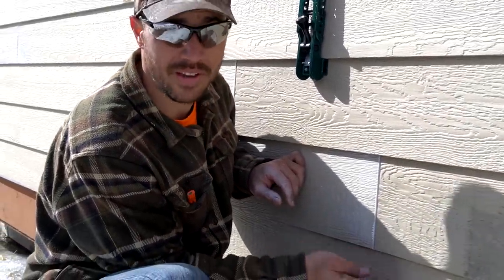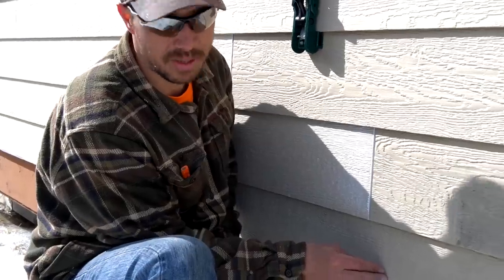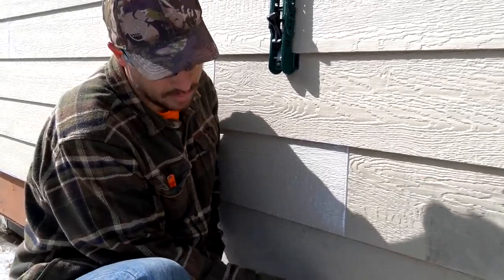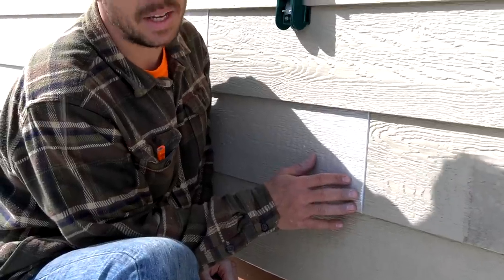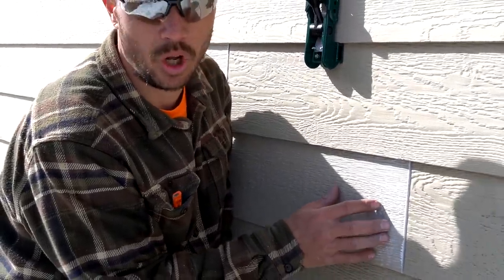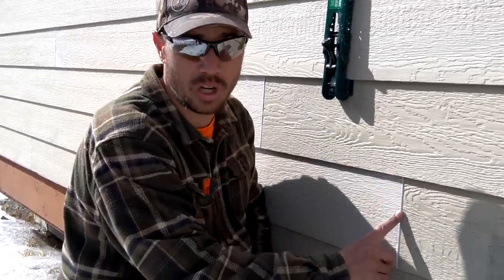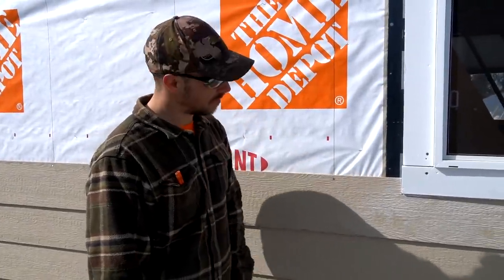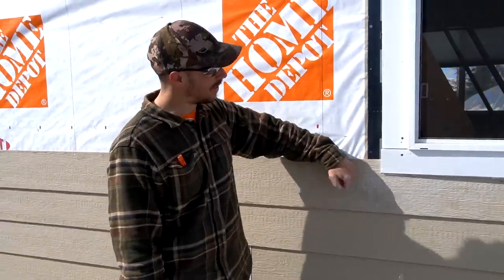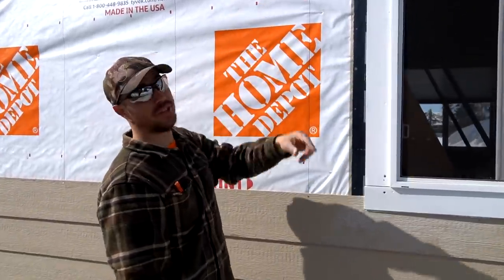When this is done you won't see a single nail — it's going to give us a nice clean look. We went with a seven inch reveal, meaning that's the part that's showing. On the bottom we had to put a starter strip: we cut a one and a quarter inch section out of a piece of siding, nailed it to the back, and that kicked out our first angle. LP siding recommends three sixteenths of an inch gap between all butt ends, and you leave gaps where panels meet trim as well, because you're going to put flexible caulking in there — this stuff will expand. The most difficult cut so far was notching around the window; it turned out awesome. From here it should be straightforward until we reach the top, where we'll have to notch out all those rafters.